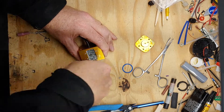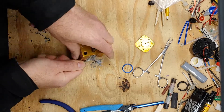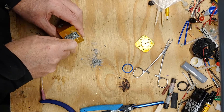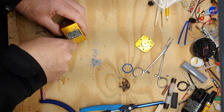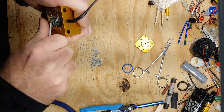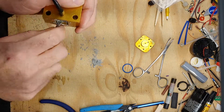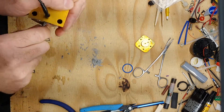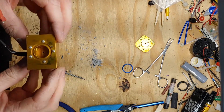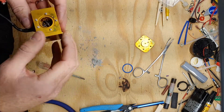At this point, ten minutes in, you might be wondering why we're going to the trouble to take apart an EI fuel flow sensor rather than just chuck it in the trash — and that is a fair question. I figure the more we pilots and airplane builders know about how our equipment goes together, the more we can visualize or better hypothesize the failure modes. For example, if your sensor were to stop working, how might it have failed? Perhaps the little pinwheel got stuck and couldn't spin around anymore.